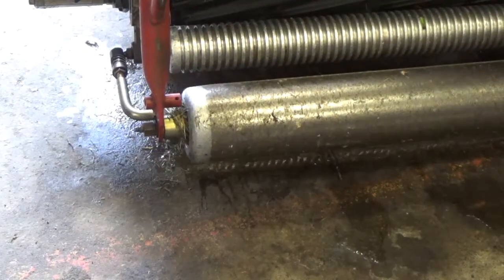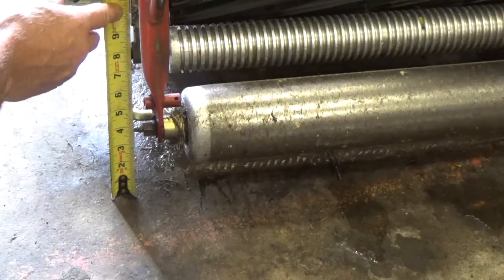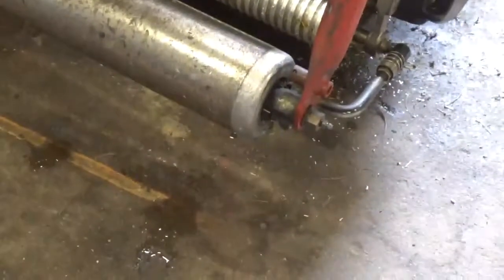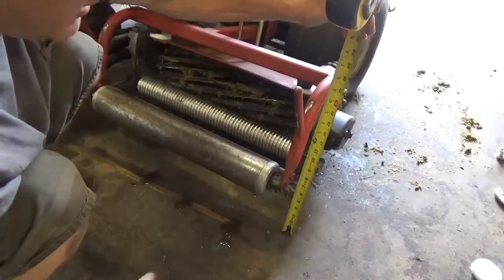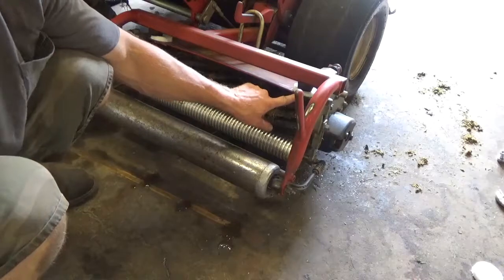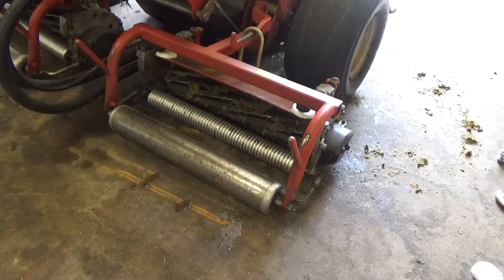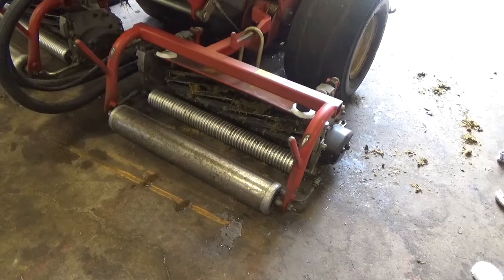Hopefully you can see this well. We're going to go by the grease fitting on the end to see what our lift is on the roller. Without the bushings and bolts holding the cover plate, we have four inches on that side that's lifted. On the side that we modified with a bolt underneath the cover plate to keep it from pushing down and a cushion, we have six inches. So we gain two inches, and when you lower it, you still have the same rollability - the roller travels across the green.